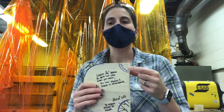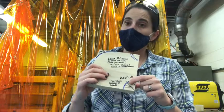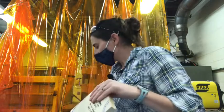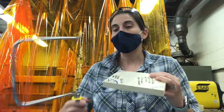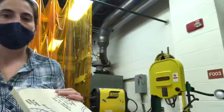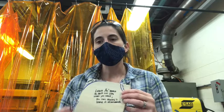If I'm making an internal curve, I'm going to want to create relief cuts. A relief cut is when I'm coming into the board - for me, I turn the machine off and then back out. The reason I turn the machine off is because, especially with an intricate cut, I know I won't be backing out the same way I went in. That could twist and turn the blade, which becomes very important when we talk about machines such as the bandsaw. The bandsaw has a full blade, and if I have a lot of twisting on that blade, it can snap.